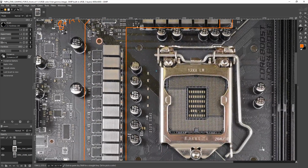So in terms of voltage regulation, it matches other top-end boards. The Unify had a smidge more overshoot, but I think the Unify actually has even less socket capacitance than this does, and it was only like 10, 20 millivolts. Overshoot in terms of voltage regulation isn't really concerning from an overclocking perspective unless it's really, really, really bad, because the only real concern with it is that it could cause